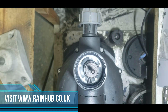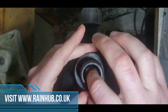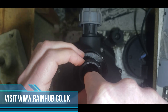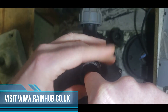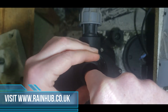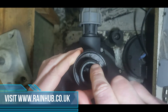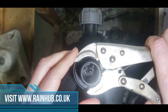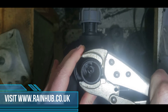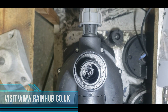When you are replacing the front part of the nose, the best way to do it is to place it on and then make sure the non-return valve is pushed all the way home as you are tightening it around your finger. This stops it coming out of the keyway and being crushed when you close it. When it's finger tight, it should move without any issue, and then all it needs is to be tightened up. Check that it's still moving, and that's how you replace a non-return valve.